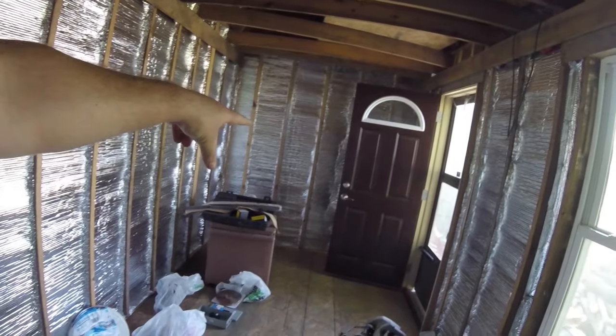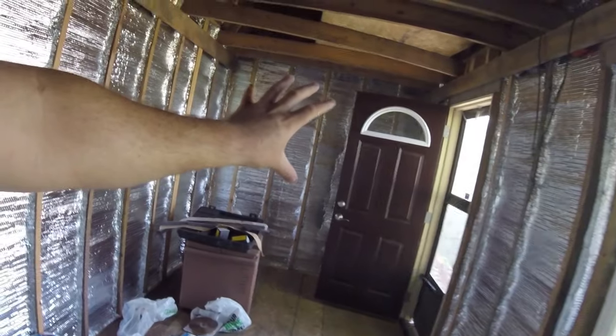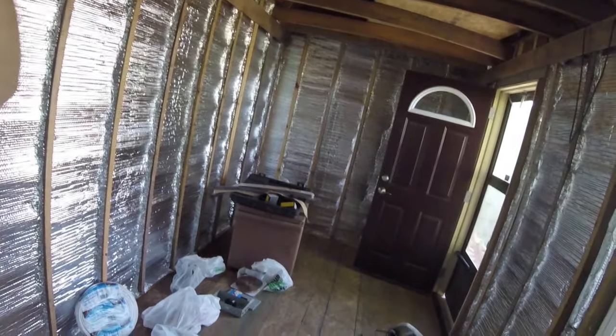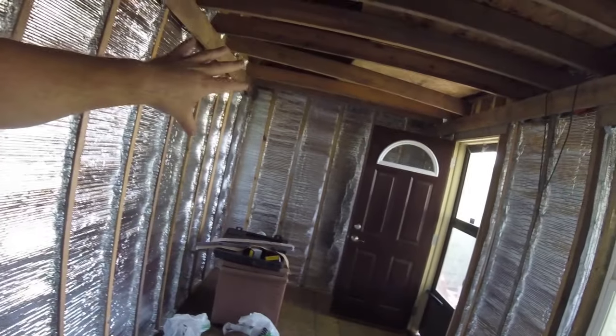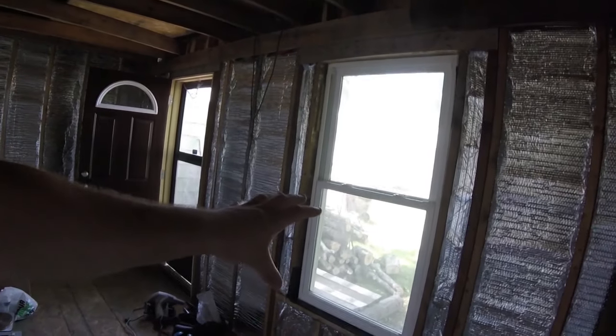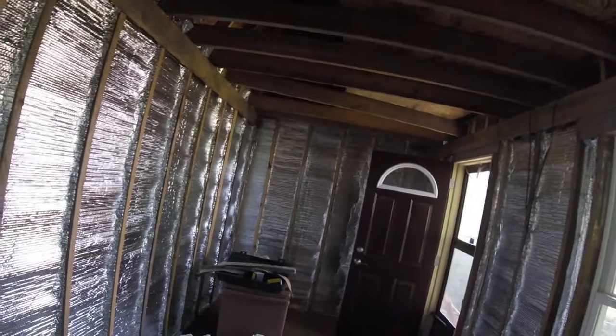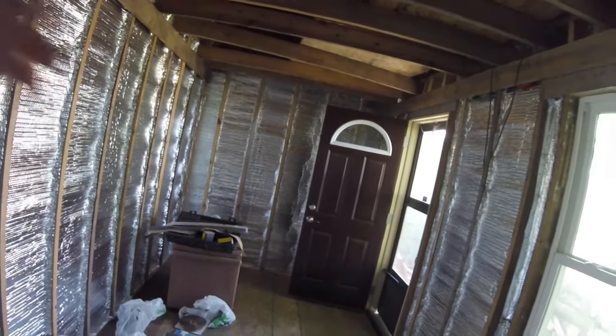I've imagined the setup in my mind. A kitchen area with a sink — a temporary sink — is going to be right there. I'll need power for at least a microwave, toaster oven, stuff like that, which is going to take up the 15 amps, and then I'll have a little bit left for lights. So I need that on one circuit for the 15 amps. And then the window air conditioning is going to take up the other 15 amps.